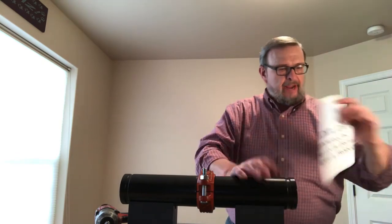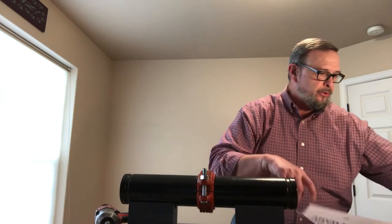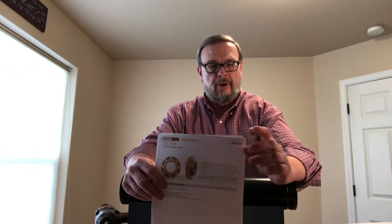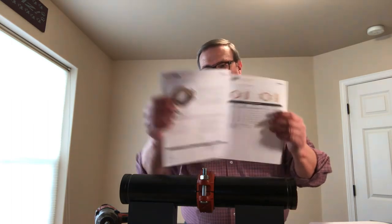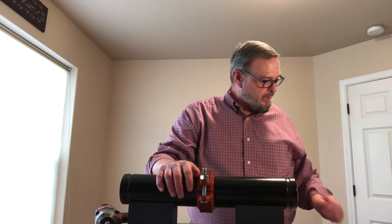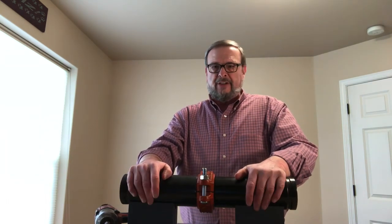If you go to Anvil International and click on Products, then click on GrooveLock, and click on Mechanical Products, you'll find the spec sheets that show you all the specs on the 7788 which is your flange adapter, and your slide lock coupling. It has all your specs there, including dimensions. This coupling goes from two to eight inch. That very simply is your Anvil slide lock figure 74 and flange adapter figure 7788.